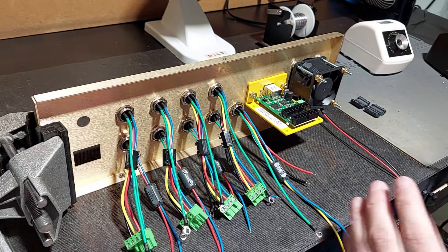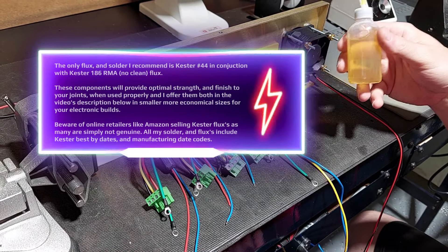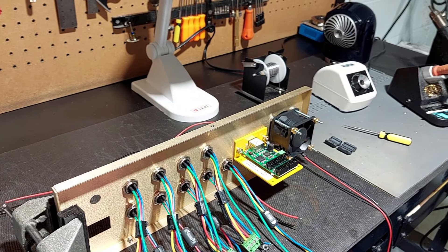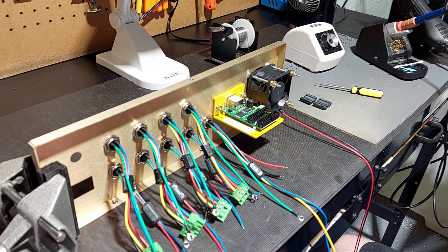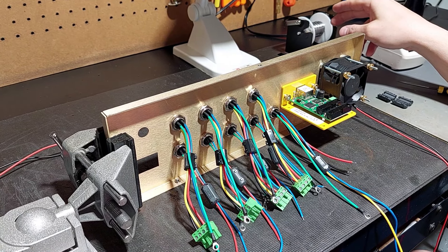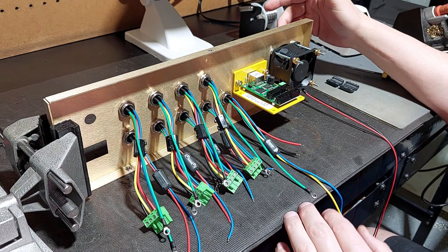I see guys doing all sorts of crazy things to try to make leads neat. The truth is, when merging two leads the main thing you want is flux — which 99.9% of YouTubers do not possess, own, or use properly — and then a quality solder. Once that weld is complete and everything is joined, you should never be putting tension on those connections. If you need structural tensile strength, you'd step up to silver solder used for brazing.